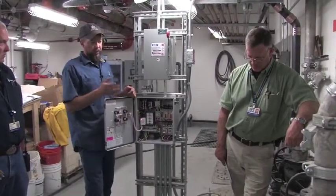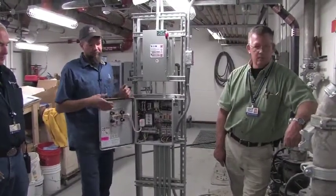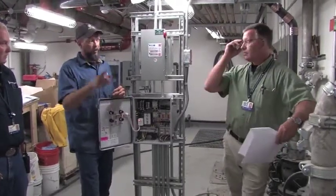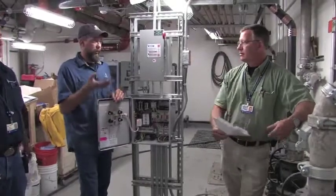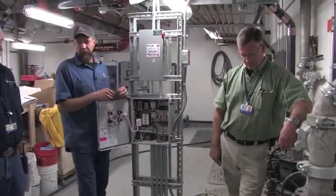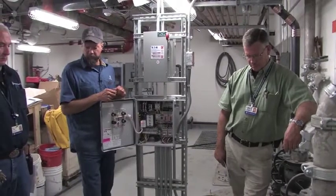Four-inch discharge, you get gate valves and check valves. Some things you might find: if one of your check valves gets hung up, you could be rat-racing — get a false alarm, pit level going up, down, up, down. And then any debris could be some sort of a culprit.